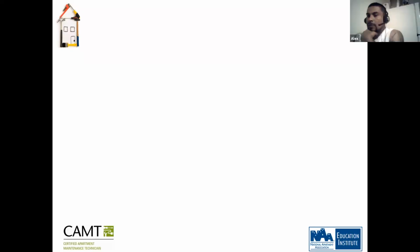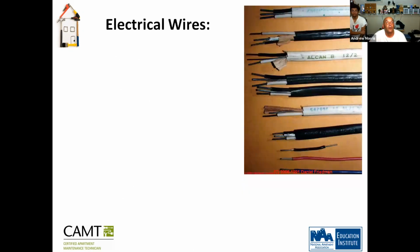Now, that's what we were talking about with that dryer, right? When it was 220 because it's a heavier appliance. Yes. Correct. So when you have three wires, if you take your tester and test the two positives, you're going to get 240, because now you're getting 115, 115 coming through, or 120, 120 coming through. All right? Got it.